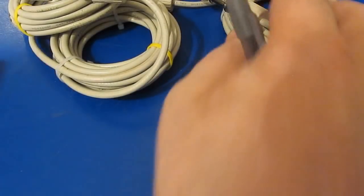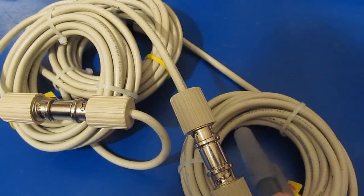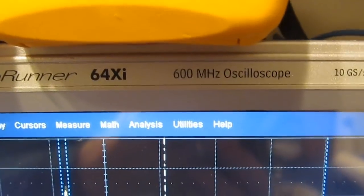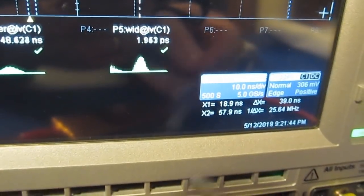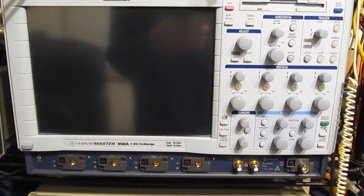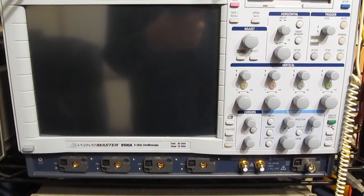So fairly close with this measurement. If we shortened up the cabling to a single piece of cable, that would increase the error, I'm sure. Another thing we could do is use another oscilloscope — this one has a bandwidth of 600 megahertz and can sample at 10 gigasamples, currently running at 5 gigasamples. You can run it on a two-channel system to get 10 gigasamples. The other way to take the measurement would be to use this old scope — this is a WaveMaster with a bandwidth of 5 gigahertz, sampling at 20 gigasamples.